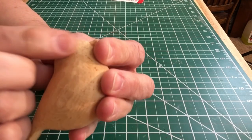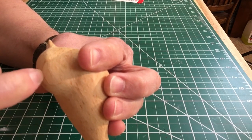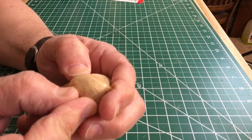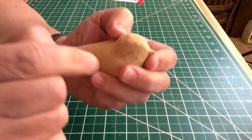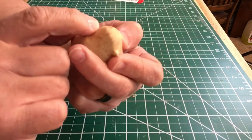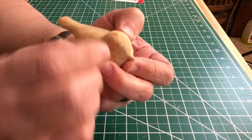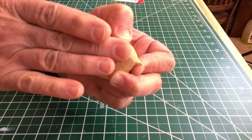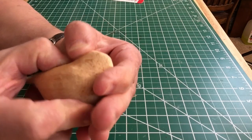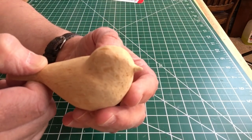It won't be a perfect fit, but you give it just a little bit of a push and a pull — and it's starting to come back. It's setting already by not putting too much glue on it. If you put too much glue on both sides, it's going to be very slippery and it's just going to slip sliding away. By doing it like this, we have a nice smooth area, and you could use just the smallest bit of wood filler in this little crack. Either plastic wood or a little bit of wood glue and some sawdust, and you could sand this and it would be a paintable piece. You can run your finger over it and you can't feel it — everything lines up perfectly. All that grain went right back in line. That's a good fix.